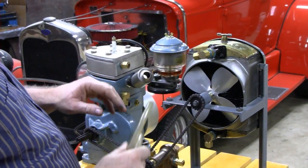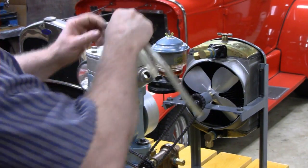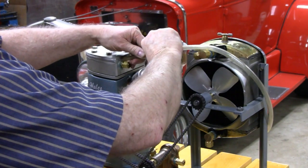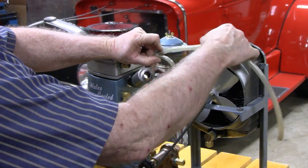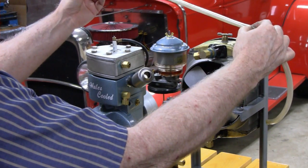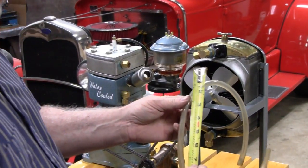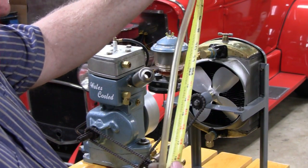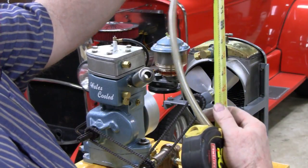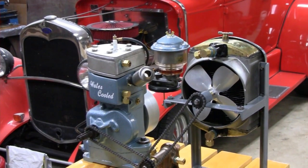Let's work on this top line. I've got a piece of dirty old vinyl hose, looks like 3/8, and I'm just going to use this as a measuring gauge. I want a little loop in the middle. Let me measure — that's about 18 inches at least. Getting a tape measure: it's pretty close, actually almost 20 inches. I'll add a little extra and take a 21-inch piece to start shaping.